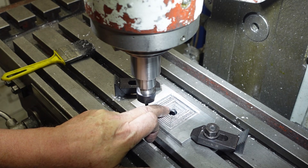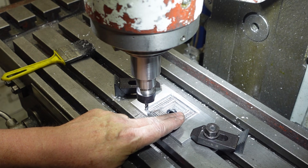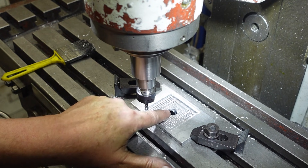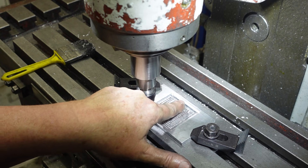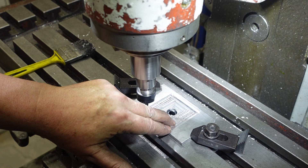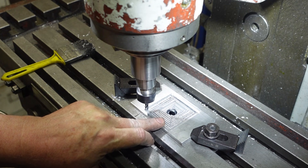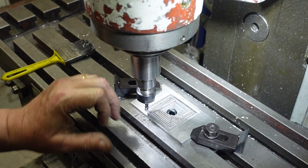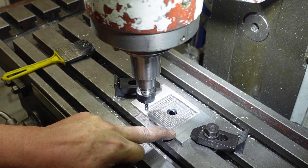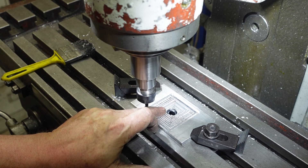I've trammed up to the back edge so front and back are parallel, and so what I should get is, if I've centered on the hole properly, an equal amount front and back. Then I'll come along later and trim the sides and put a radius on. It's pretty straightforward milling - I've just gone around in a spiral to chew the material out, but apart from having to preserve it so the material doesn't distort, it's a pretty straightforward milling job.